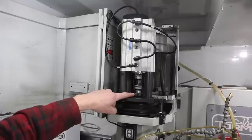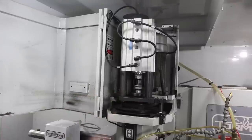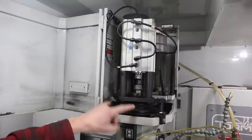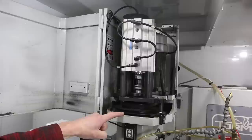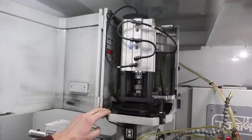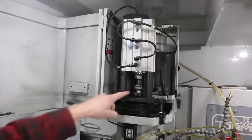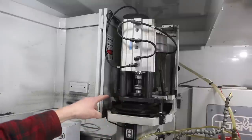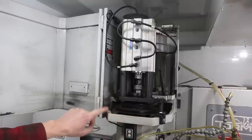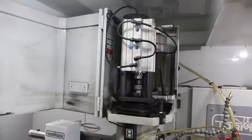What's also cool is the way this is set up - there's a collar here that's attached to the spindle, so it's pulling straight up, and what it's not doing is transferring that force through the casting of your housing. I'm not an engineer in that sense, but I have to think it's better to be pulling straight up on that metal machine part where you've got support and rigidity, versus trying to flex or bend the cast iron. Anyway, this thing has been bulletproof for me - I can't tell you how many thousands of times I've used it.